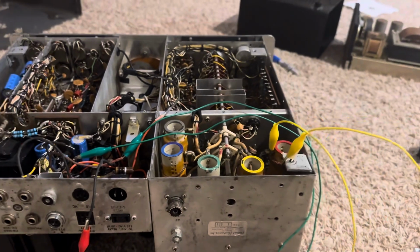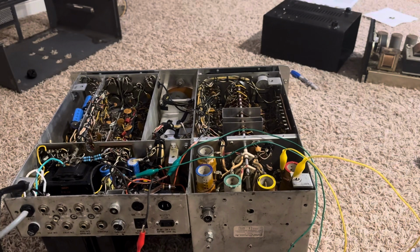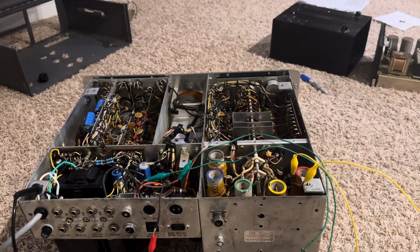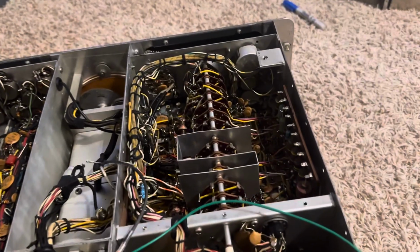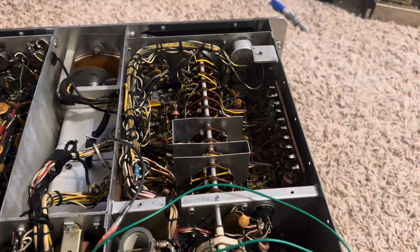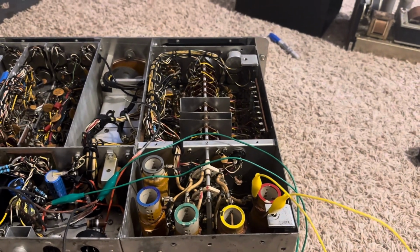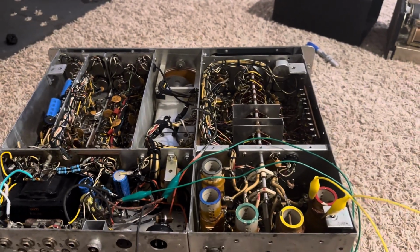And I think that would resolve this thing as far as it will have close to 600 volts for transmitting. It will have its 340 volts for the rest of the tubes in here for their plate voltages, and that should resolve it. I think I broke it though, when I was fixing the short under this metal strip thing here, this Z thing. I think I broke something else fixing that short. So I still got to figure out why it won't transmit anymore. But I really can't do that until the voltages are all correct. So then that'll be the third problem to figure out. And once that's all done, we'll see if it works.